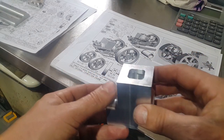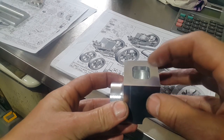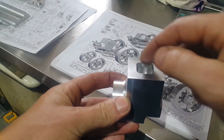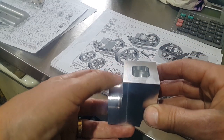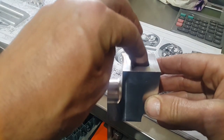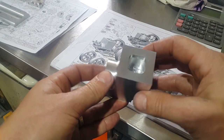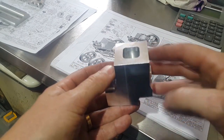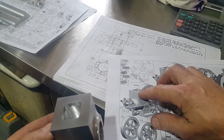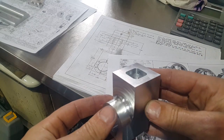Well, that turned out to be a bit of a mission. I switched the camera off in the end because I just had to concentrate on what I was doing — the boring bar was inside here, and once I got down below this level the boring bar was wider than the opening, so I was going up and down removing material but I didn't want to come up too high and just destroy this edge. Anyway, it's turned out well, I'm really happy. That's it on that now. The next stage is to do the machining at the top here — put a small radius in around and cut the material to leave this upstand. That's my next job.